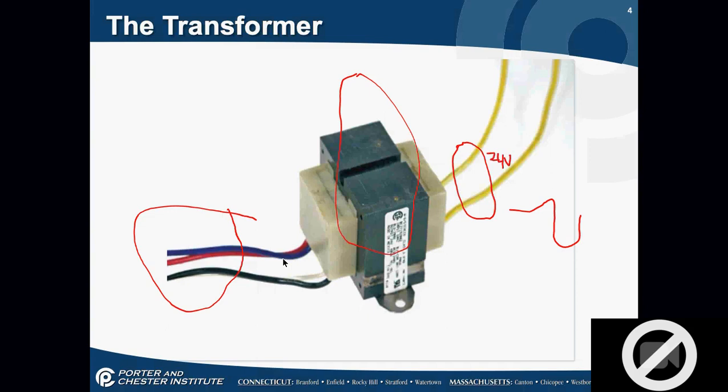What type of transformer is this? Step-down. It is a step-down. What about the four wires? Has anybody mentioned multi-tap transformer? A multi-tap transformer allows you to use multiple inputs. My white wire is always considered common or neutral. There's always a label on the side that tells you what it is. My black wire connects to 120 volts, my blue wire could be 208, and my red wire could be 240. I can use this single transformer in a number of different voltages.